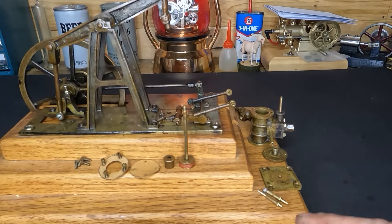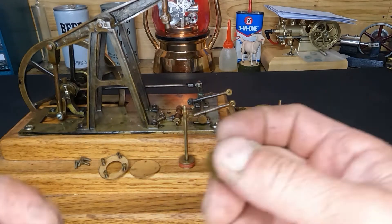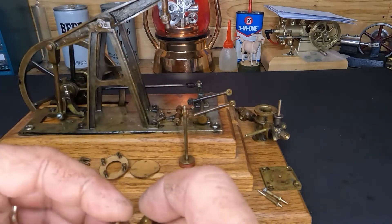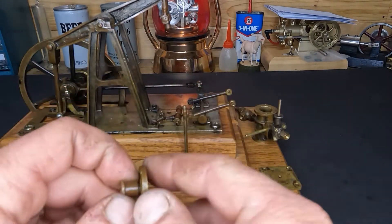So let's get after this. Our cylinder gland packing that goes on the top up here — we've also fitted, you see that little guy down in there? That's just another steam grade silicone O-ring and that will seal the top of our cylinder.